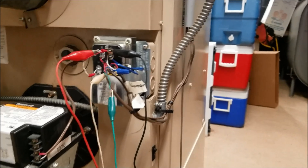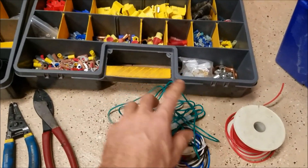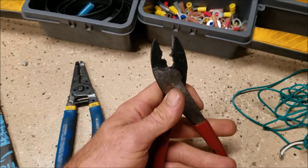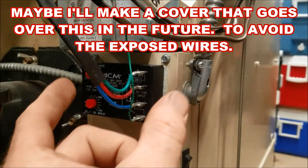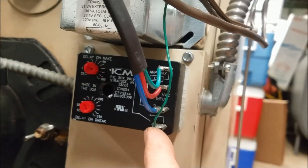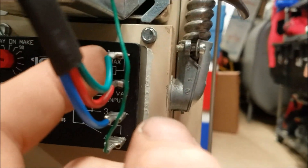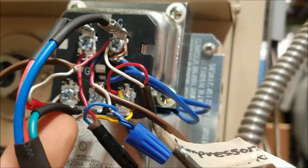And look at this — made in USA. That's nice to see. For the final install I used some wire I had laying around, spade connectors, heat shrink wrap, and wire strippers and crimpers. If you don't know how to crimp ends, check out another video on that. I used the sticky pad on the back and put some dabs of silicone on the back of it too — let that dry and it'll be on there nice and secure. To recap the wiring: the green fan signal from the thermostat goes to number four; the blue common goes to number three; the constant 24-volt red goes to number two; and coming out of number one is the fan signal that goes over to the green terminal on your block.